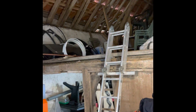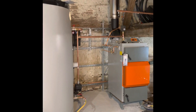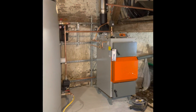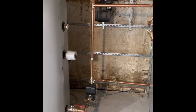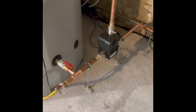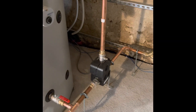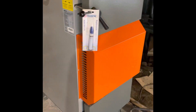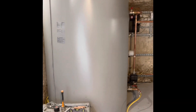The slab was done by hand. I've taken the ceiling and roof out that was here — this is the barn as it is. The floor did continue straight across but that restricted our height. This is the new heating system: that is a 2000-litre accumulator tank, and that is a wood gasification boiler — 40 kilowatts. There's quite a lot of gubbins involved, with regulating the burn temperature to optimise combustion — it's an all-singing, all-dancing modern system.